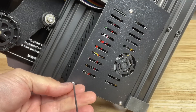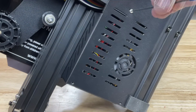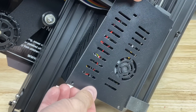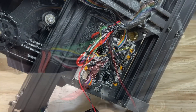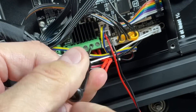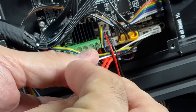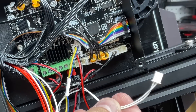Flip it over and there's three screws on the bottom — two short ones in the front and then one longer one at the back. Once you get that cover off, it's still going to have a fan connected which you can disconnect if you want; I'm just going to leave it connected. There are two screws in the terminal block that hold the wires for the hotend. Just loosen those two screws — they're the red wires with the heavy insulation. Once those are loose, you can pull the wire out. Next, pull the white connector off on the end — this goes to the thermistor.